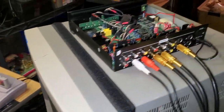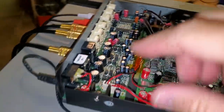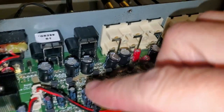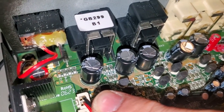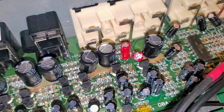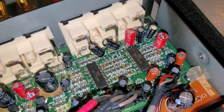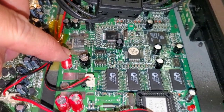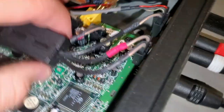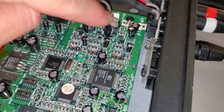Let's move on over to the time-base corrector itself. This is where those bad capacitors were originally. You can see there's still some of that caked-on residue — it's almost like some kind of epoxy at this point; I wasn't able to get it off any more than that. I did thoroughly clean it and everything should be good. All those solder joints look nice. I even had to replace some capacitors on this card over here — a bunch of these had gone bad, and these two right here also go bad a lot on this card.